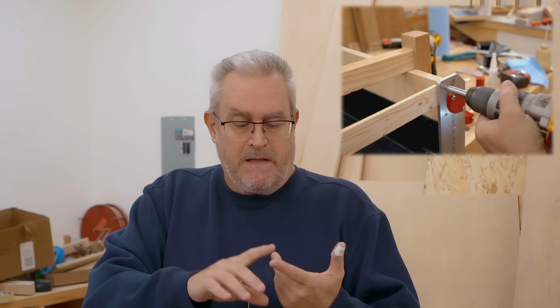So I said, one of the things that I want to do in this new machine is to reduce the height of the gantry sides. That means I could either start with a very tall concrete base, where the sides would go up another 3 inches with the concrete, or I said, I can build a structure on top of that bolts down securely to the base, to the top of those rails, and facilitates the linear bearings and the lead screws, with space in there for those 2 things. Because if you extend the sides up with concrete, you don't have any space for that.